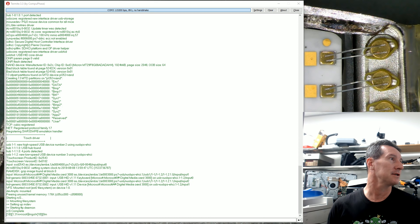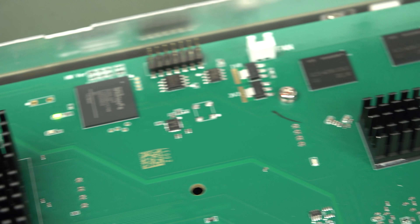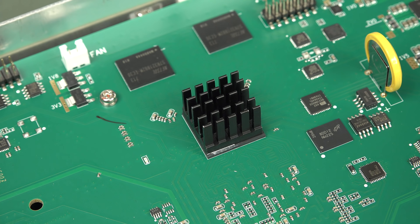Hit any key to stop auto boot. I've plugged in a USB keyboard — whack a key. Did we get it? Nope, it didn't stop. I was pressing the keys but nobody's home. And it doesn't seem to boot with the transmit line connected — it's only the receive line that seems to work.